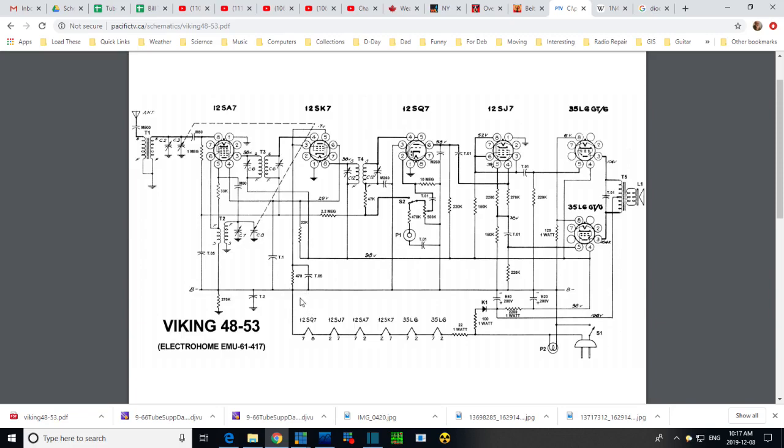Now, we're looking for a hum developing in here. And I heard the hum on the plates of this tube, the diode right here, right on this pin. I could hear the hum. The hum is either being initiated right here somehow, or it's initiated earlier in the radio and is somehow coming through. You know, from here forward it's audio, but from here backwards it's RF.